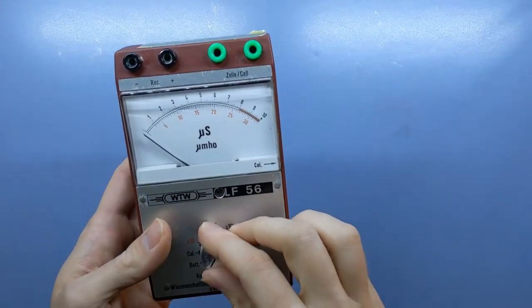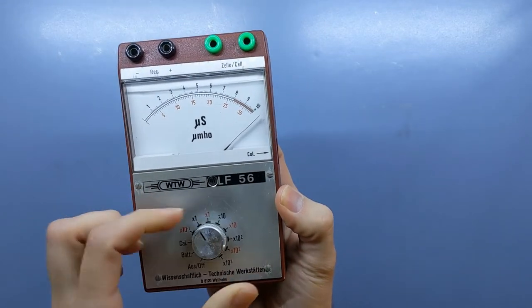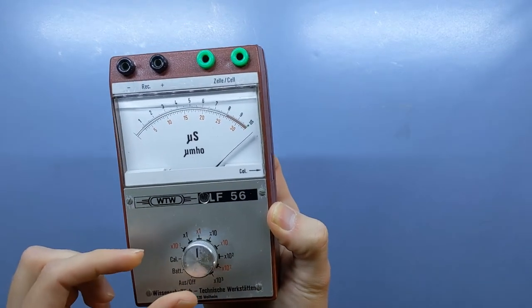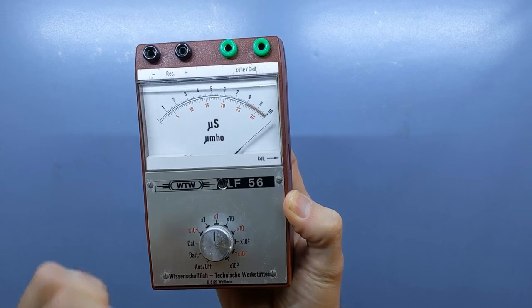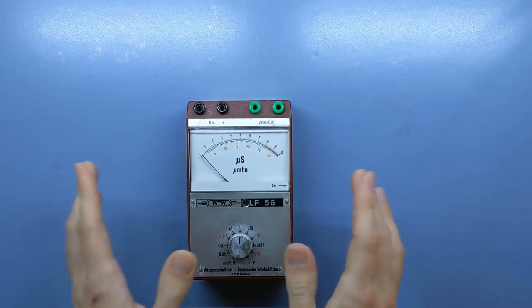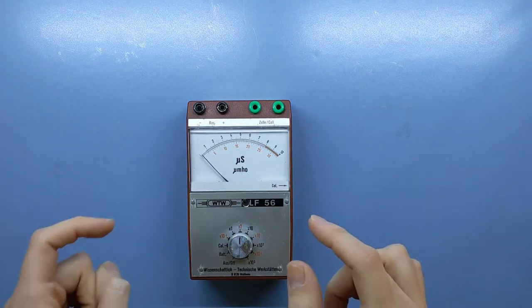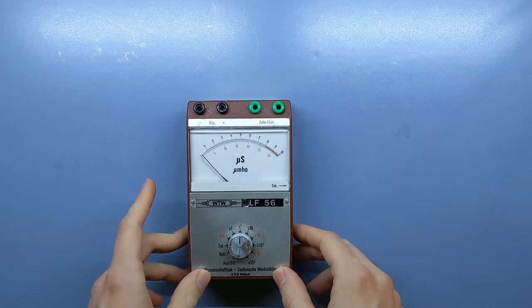Another issue is, I'm going to turn it on and bring the meter to the max, or the gauge to the max. The buzzer is way too silent when inside the case. So before we finish up the outside, we will have to replace its 330 ohm resistor with a 10 ohm one.